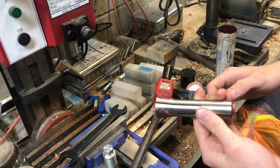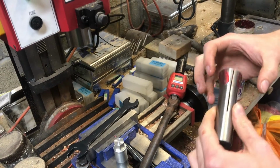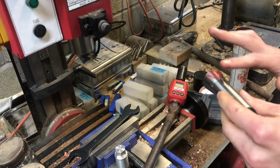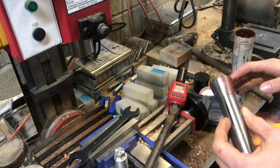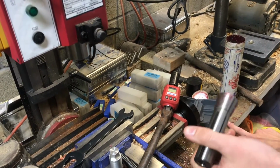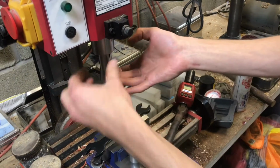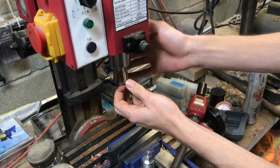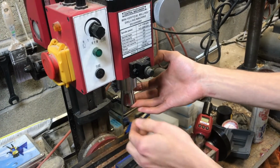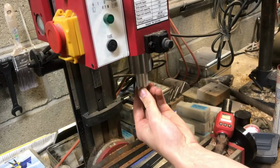This is going to behave a little bit differently because this is actually lubricating the taper surfaces, and in theory that would allow the taper to slide in farther or with less friction. But the question is, will that actually improve your clamping force at all? It's important that you don't get any grease through the slits into the inside, because that would definitely skew the results if it got onto the workpiece.